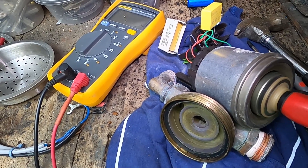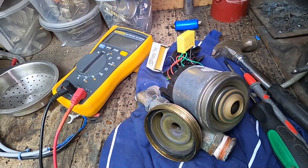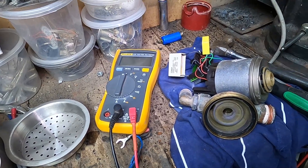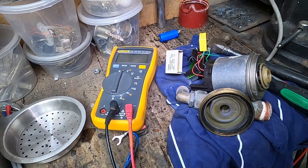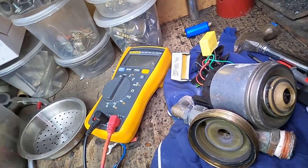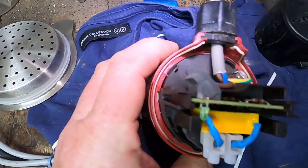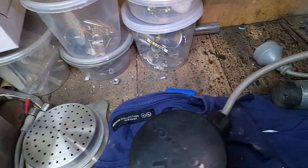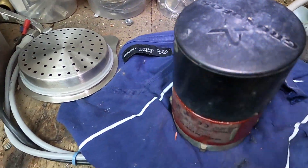It's pretty happy - there you go! We'll call that a win. I'm going to order up the right cap, but because I want to get this going tomorrow I'm going to slap that temporary cap in and hope for the best. Because it's smaller it might run a bit warmer, but it was just cooking before and not running at all. Let's see how we go. All back together, nicely glued, got that temporary cap in there, and all good to get reassembled back onto the heating system.